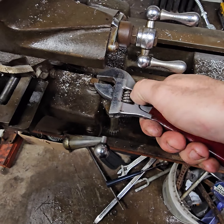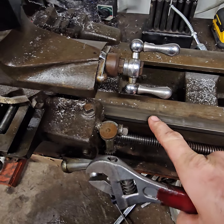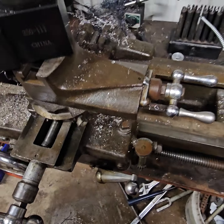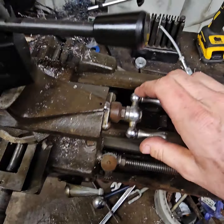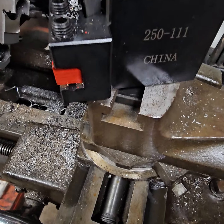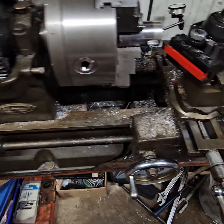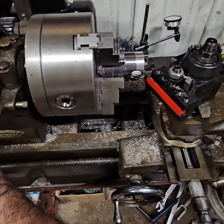I like the feature on this lathe. There's this little screw here. It's a lock. It locks the apron. This is the apron to the bedway. Now that's locked. I can't move that. It's not going to move. It makes it more rigid. And now I use my taper attachment, which is at 90 degrees, so I go in and out with my taper. And that gives me a way smoother cut, but without that, for facing off aluminum for sure, it's easy.